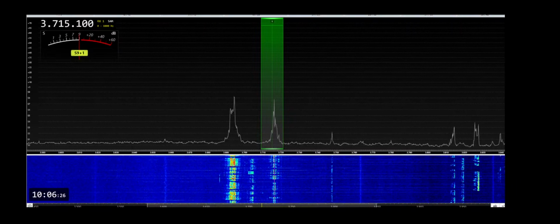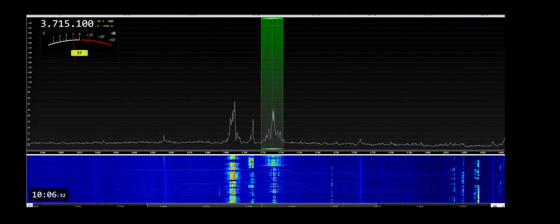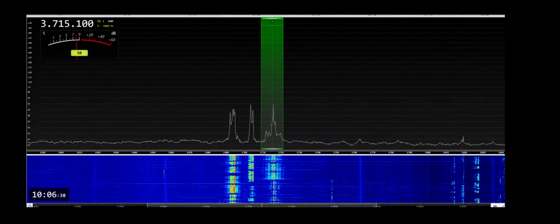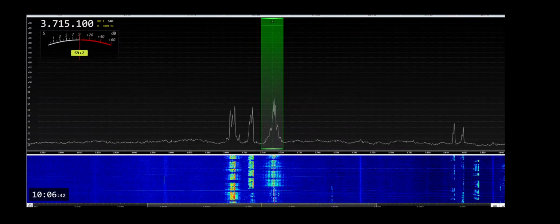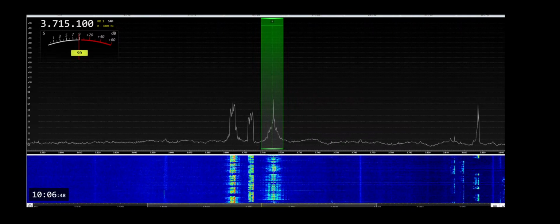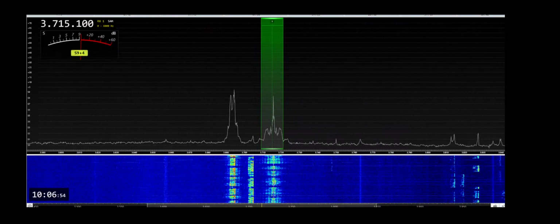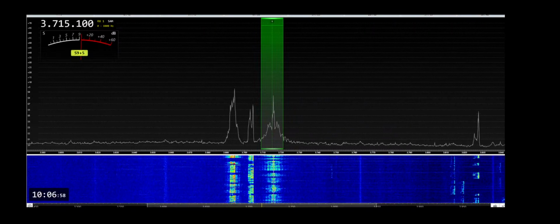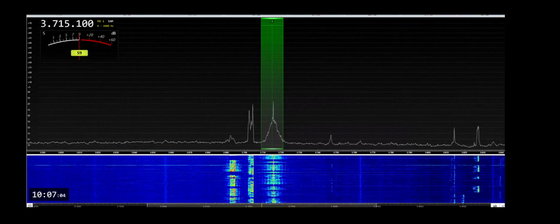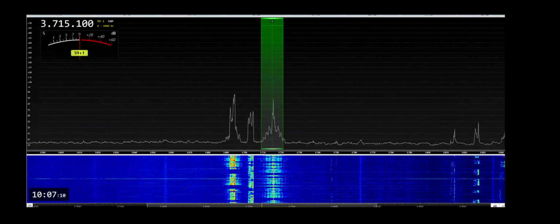K4GDN, this is WF2U. Okay, Mayor, WF2U in the room's K4GDN. Yeah, Steve, your comment about the 811 is interesting. I guess my homebrew is kind of similar to a courier. I've got pi tuned inputs on mine, and I think that works pretty well. Like I say, I have never really had any problems with this, and the handbook indicated you could run 350 mils of plate current and about 60 mils of grid current, and it was a half kW input. This was, I think, in the 66 handbook. Yeah, it's been in several of them.